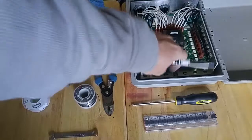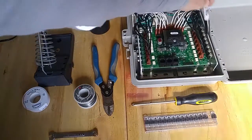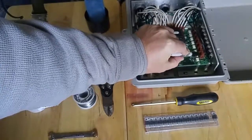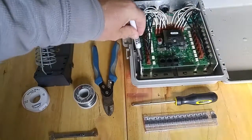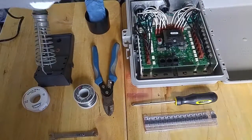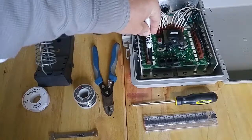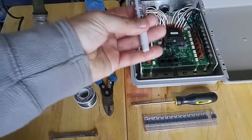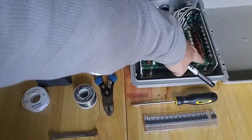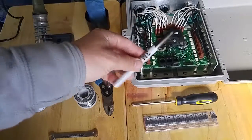Sharpie — looking at mine earlier, they look like they're already marked. It's kind of hard to see on camera, but this is port one through eight and this is nine through 16. They're already marked, so one through eight here. Basically what we have to do is take the heat sink off the board, off the container, and then undo all these wires — every one of them. It's very easy to know where they go because all the neutrals go here and all your power wires go here. But if they're not labeled, you'll need a Sharpie to mark them as you take them off; they are labeled on the board — number one, number eight, number 16.